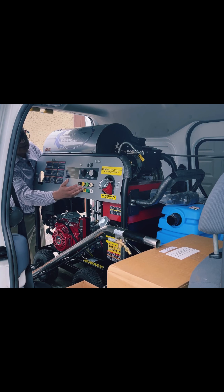In this particular install, I unlock the wheels and pull it a little closer to the edge. The reason is this machine has two exhausts — one is the engine exhaust and the other is the diesel exhaust. I want the diesel exhaust past the point where it won't heat up the top of the van or cause any issues. So when I use it in here I just pull it out a bit. If you want to do pressure washing you hook this one up, and for carpet cleaning you take this one inside and use it for the pressure.